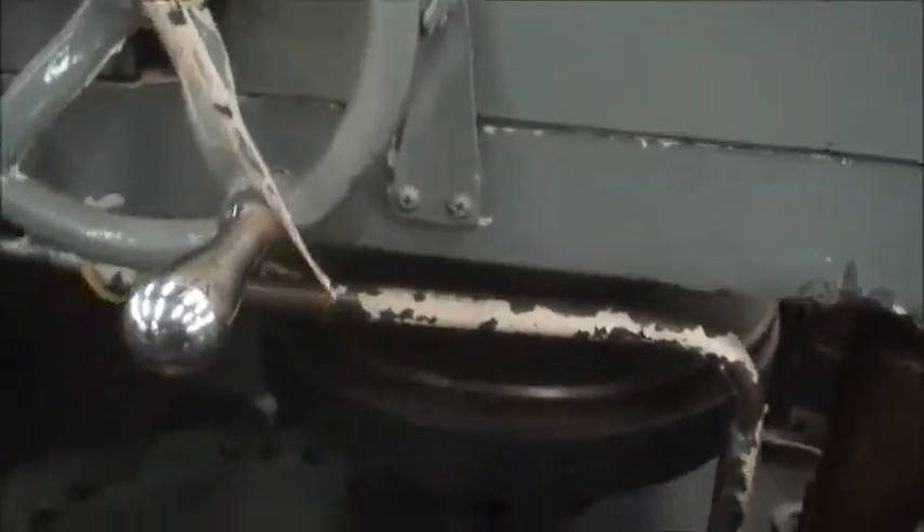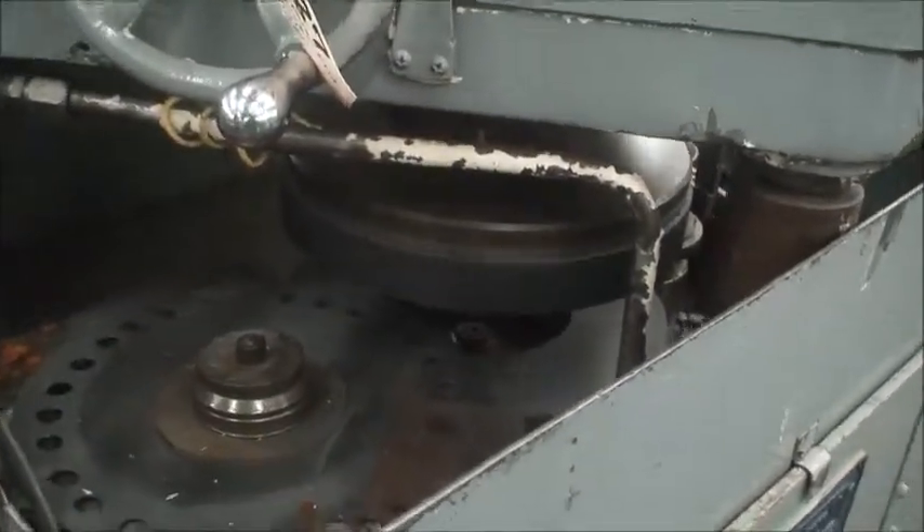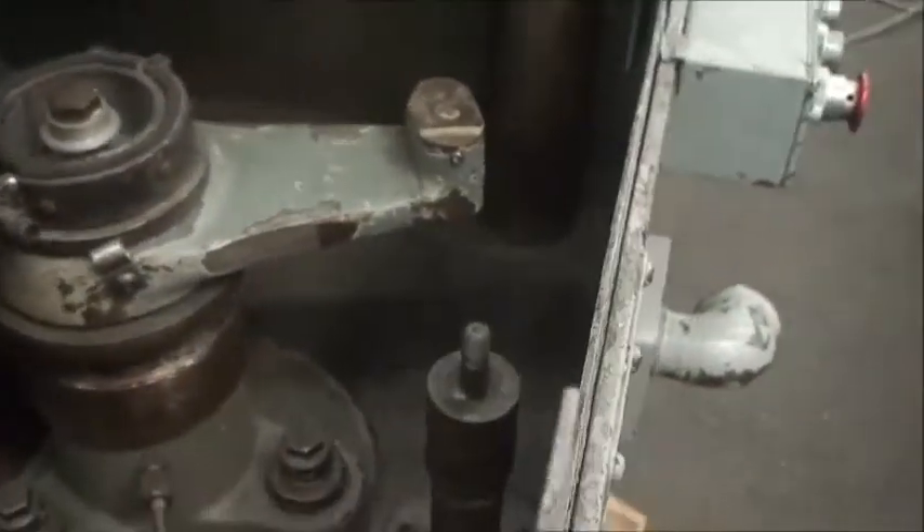Each head is adjustable. You have a vertical adjustment for the top wheel and a vertical adjustment for the bottom wheel. There's also this double-ended diamond wheel dresser unit which, when turned on, rotates in a cycle into the wheels. Each wheel would be set simultaneously and the dresser would pass under completely and around and back out.